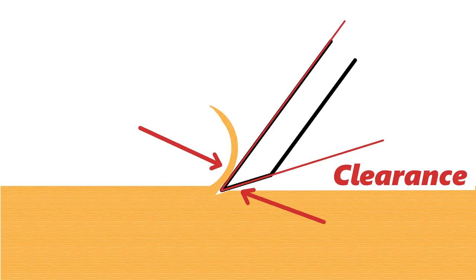I hear the skeptics saying: okay Rex, that's a very nice edge — I see it shave a hair, I see it trim a piece of wood — but where's your exact 25-degree primary bevel? Where's your 30-degree micro bevel, and how are you maintaining that with freehand honing? The answer is I don't worry about any of that stuff because I think it's pretty much nonsense. The bevel isn't leading the cut — the back of the iron is doing the cutting and forcing that shaving to curl up. The bevel has some contact with the wood, which is why we polish it, but the main thing is that the bevel needs to stay out of the way of the cut — that's why that angle matters. It provides clearance so the bevel doesn't drag or keep the edge from cutting. There's no need for an exact 25-degree bevel; 30 degrees or even 35 degrees will work.